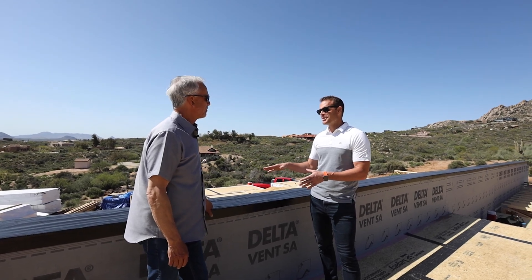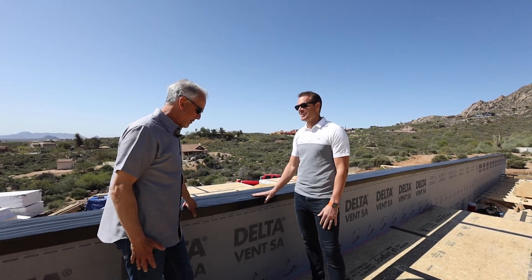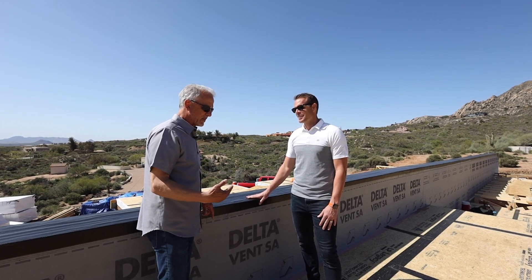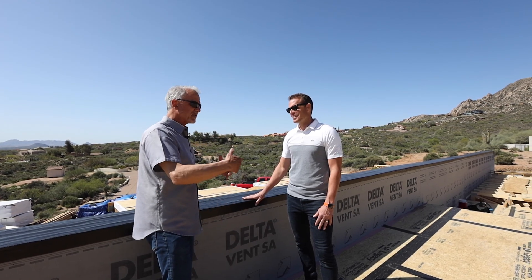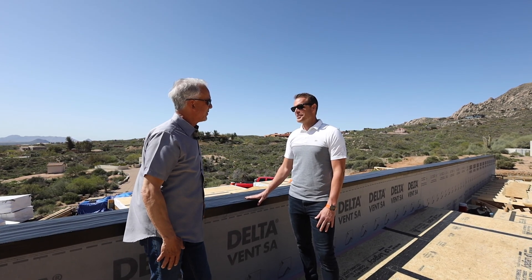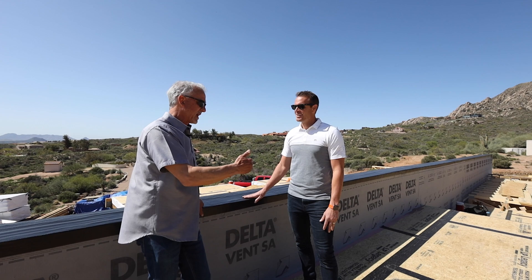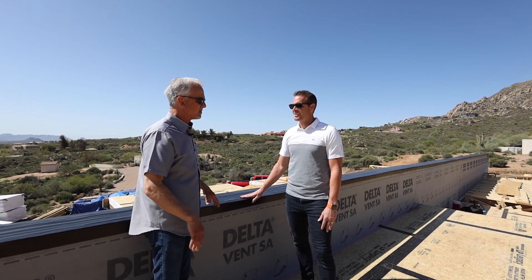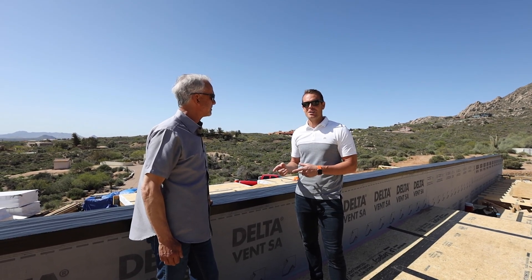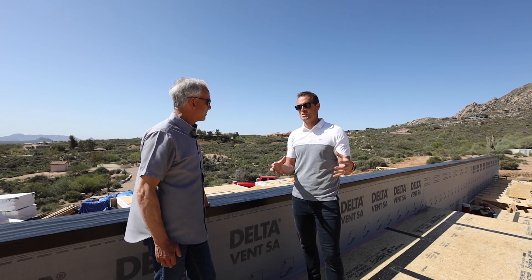Even at this stage of construction with the ICF and the waterproofing done, we water tested this — we put water on top and it was amazing how nothing went through to the layer below, which is a testament both to the Legacy and to the taping of the seams. Such an easy process — no one would really ever do this, but when you look at it, it seems like a good idea and it makes a difference. In the long run, this is a hundred-year-life building, and these seem like small steps but they're the ones that really help the house maintain its longevity. Make sure to tune in to our YouTube channel, comment, like, and subscribe — you're going to see amazing details on waterproofing and the structural integrity of this net zero house.